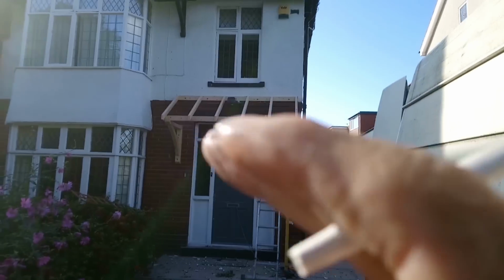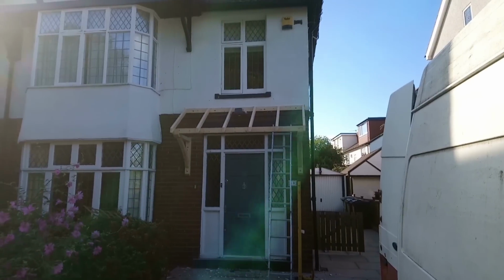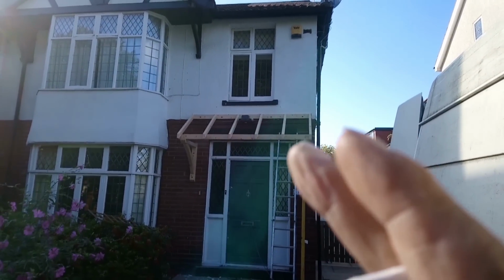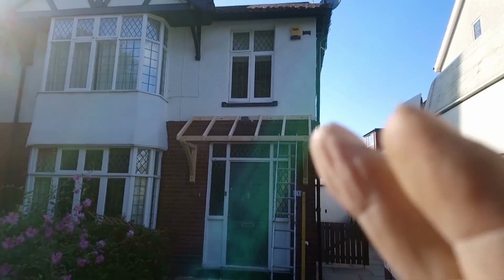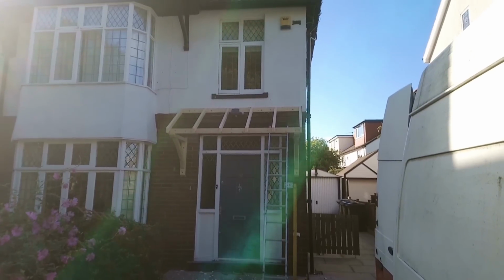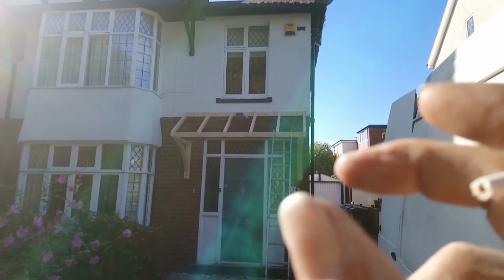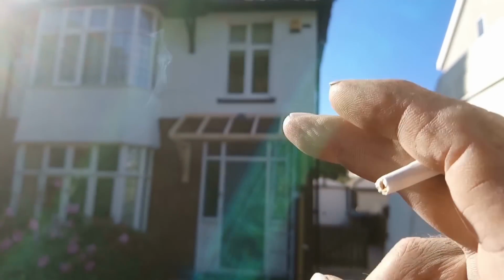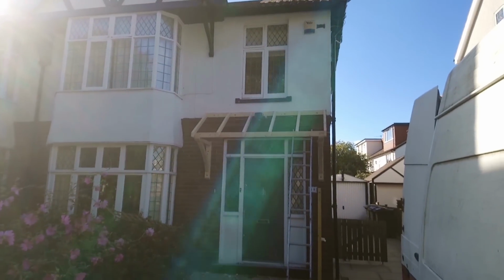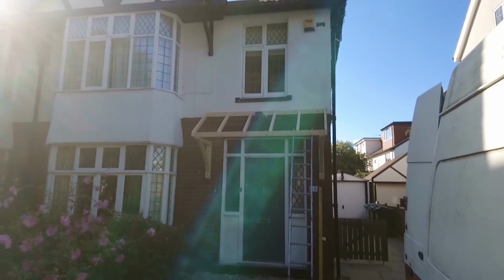Right, when I worked out the spacing for those, I was working on about 400mm centre to centre, but I wanted them even. To get them even, you saw me put the gap in between, which was 437 plus the 44mm, so about 480 centre to centre. If I'd made it smaller than 400mm and got another one in, evening it up, they were just too tight together. So centre to centre about 480, but I was working on around 400.